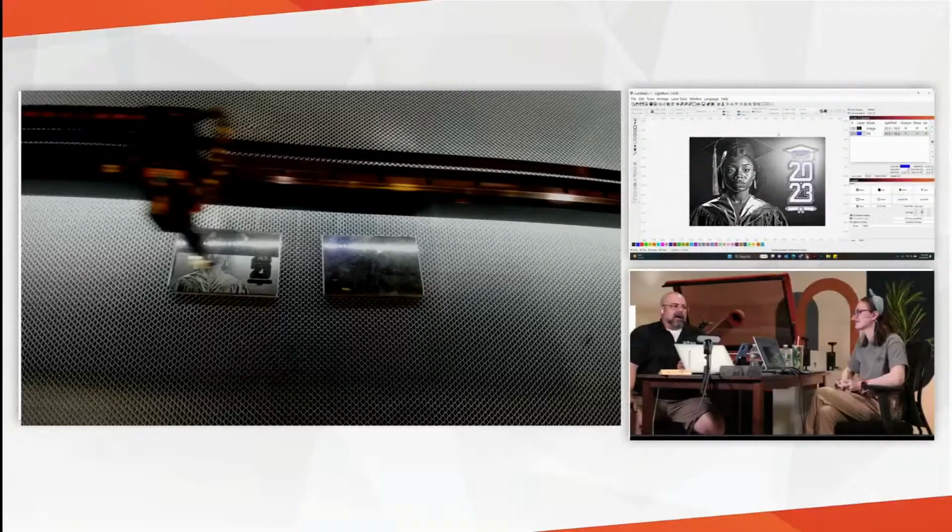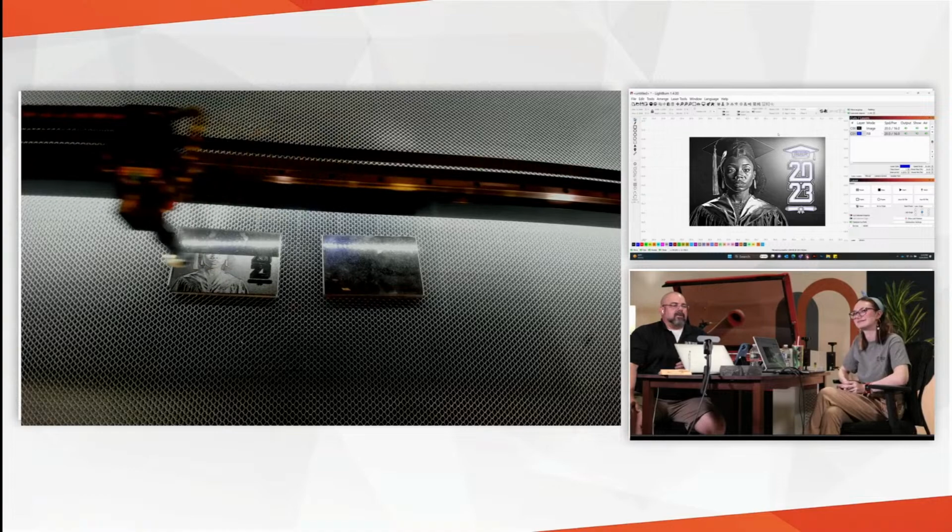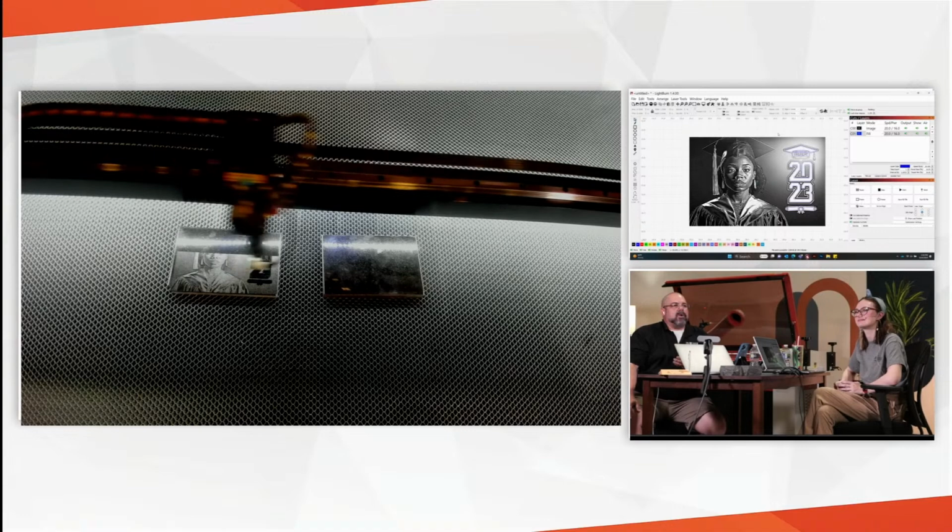So what I want to say is that you'll hear a lot of people talk about scattered radiation and the dangers of that. Well, that's nothing more than light radiation. What you're really worried about is if you're doing metal, you definitely want to be cautious and make sure you're wearing eye protection, because off of metal we might get reflections. But once that laser beam has scattered, it's not posing a risk. It's non-ionizing radiation. What does that mean? Well, X-ray uses ionizing radiation, where the electron actually breaks away from the molecule and can actually do damage. That's why you have to limit yourself to ionizing radiation.